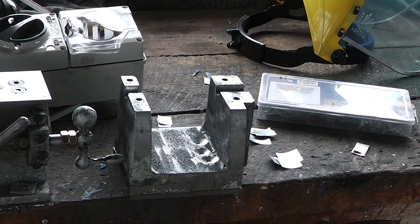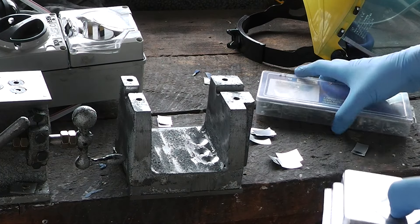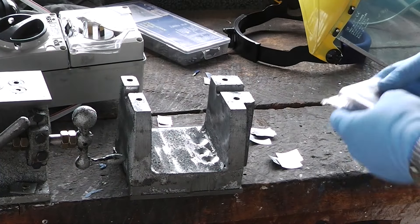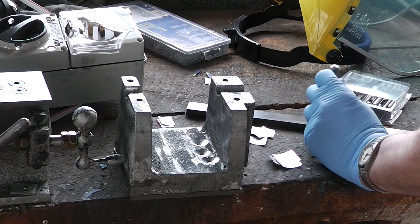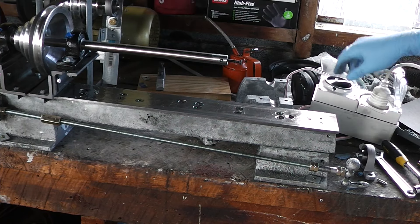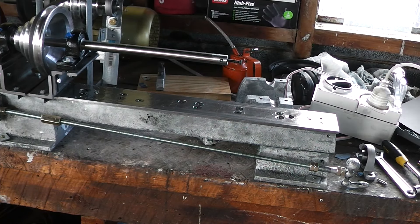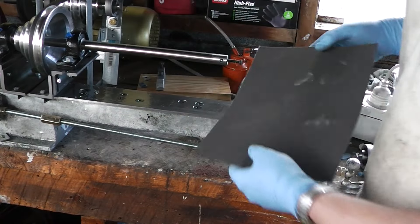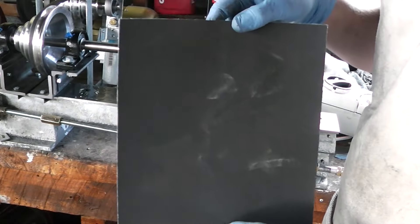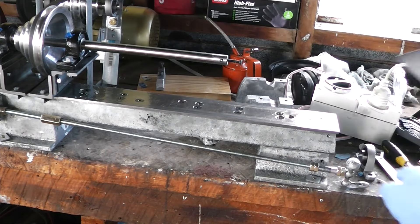I'm using aluminium can shims because I'm tired of using up my good shims on these. So the plan is to set the lathe going and use the sandpaper to reduce the diameter a bit — with 180 grit, not the 80 on the belt sander.